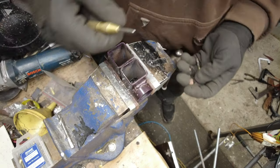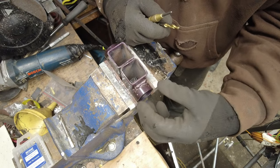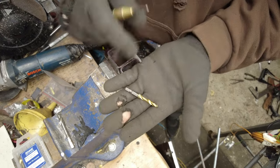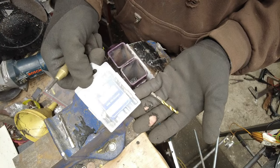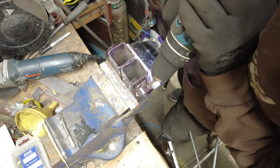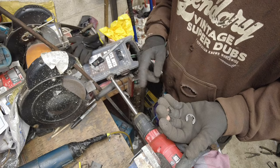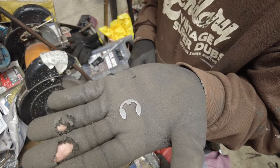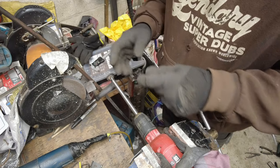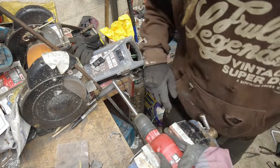I'm just drilling and tapping a couple of holes in the bearing retainer. When the bearing's in there there's a little bit of movement — not super tight — and I don't want it rattling around as I'm pretty sure it'll do damage quite quickly. I'm drilling and tapping these using a combination drill tap; I got these particular ones from Rennie Tool Company on eBay — I'll put a link below — they work very very well. We're going to cut the end of our coach bolt and put a groove in it so we can fit a little circlip in there, and that hopefully will mean we can fix the bearing and the rod together so they don't pull apart.